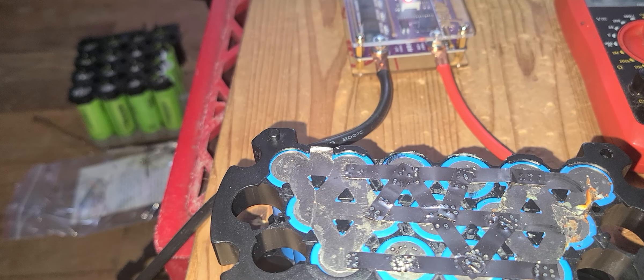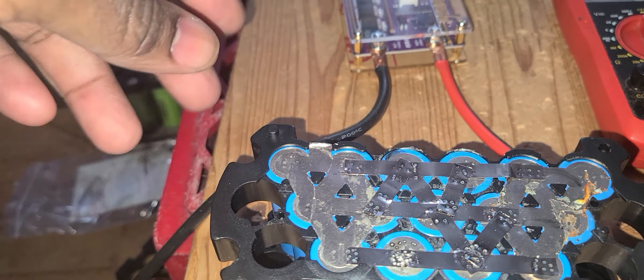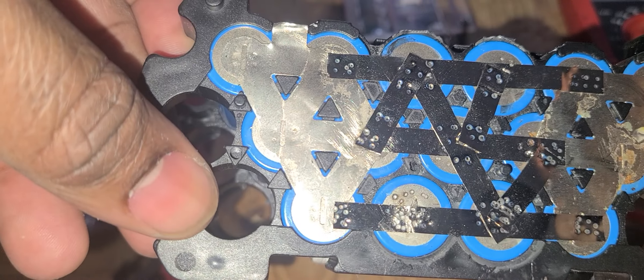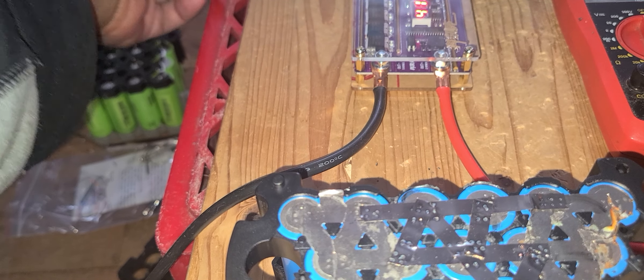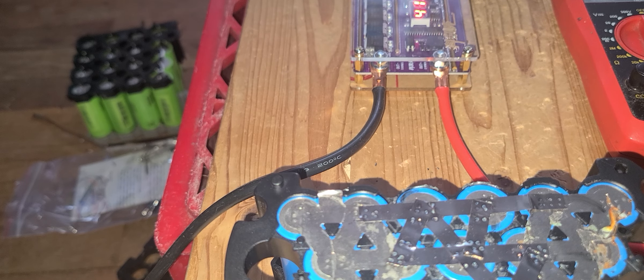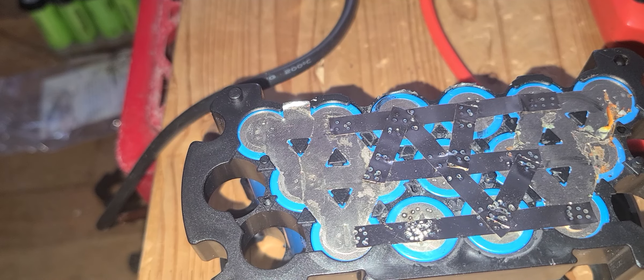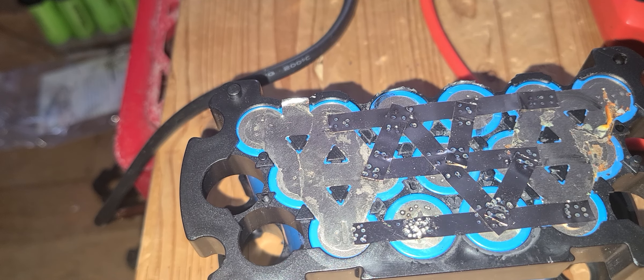Guys, stay tuned — you can see more videos. I'm sorry about this one. There's nothing wrong with the spot welder though — it's just the spot welding results I'm having a hard time with. If you look at it, it does spot weld. I think the power issue is coming from the cable — the cable is too long and it's warm. Until then, guys, don't forget to subscribe — it helps the channel tremendously. I'll give you updates with all these batteries. I have a lot more video on this spot welder. Thank you guys — see you next time.